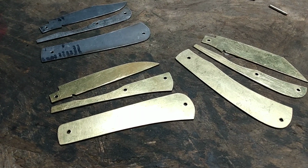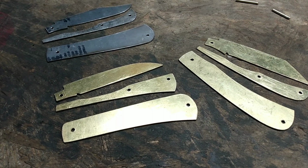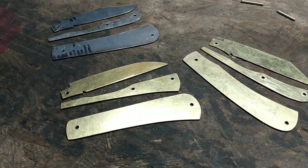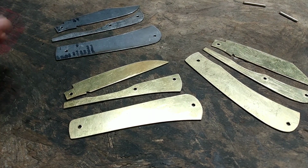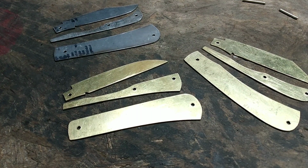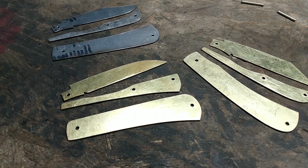And I've tried that, and I didn't have much luck with it because I am not good at all at being precise when I am shaping things. I can get things very close, and I do a better job at working it in, say like when I'm setting up my tang and back spring on my rice fall jig I made. And to my understanding, a lot of makers, whenever they're scribing lines around their tangs, are leaving things proud anyways. But they'll have their liner holes pre-drilled as well as their back spring holes pre-drilled. And for me, that just caused me to scrap more parts. So for me, I'm not quite wired to do things like that.